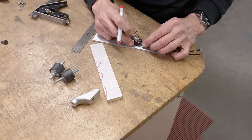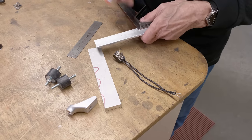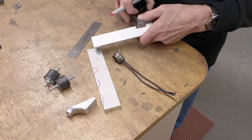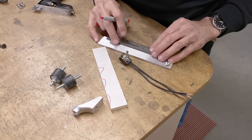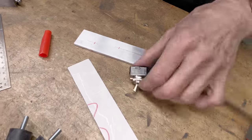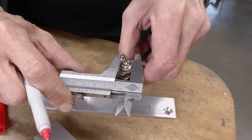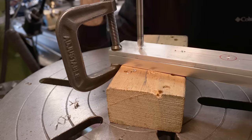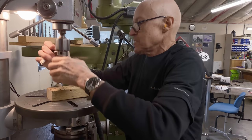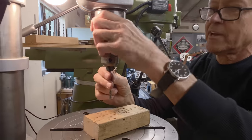This is going to go here — we might have it offset, more towards the outside of the bike, be easier for me to reach. These are an inch OD so I'm marking in half an inch. It doesn't really matter where they are because I'm going to drill both of these at the same time. If I drill a hole a little bit less than half an inch, that'll go in there nicely. Next I drill five millimeters, because that's the tap drill size for a six millimeter thread. You all knew that, right?